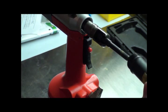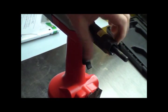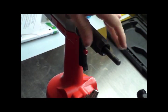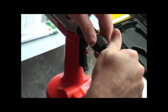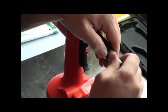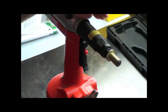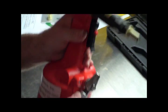I'm going to pop it out, make sure that driver lines up, and press it in. Then slide my mandrel housing over and thread it back on. I'm going to get my anvil ready — once this is threaded in place, I'll thread my anvil back on. Keep in mind, we want maximum threads engaged. I'll thread the rivet nut on to make sure it's flush, move my anvil to meet it, lock everything down, and then actuate my air pressure.